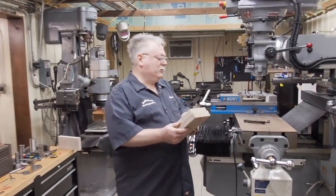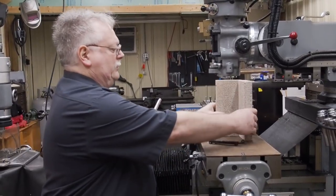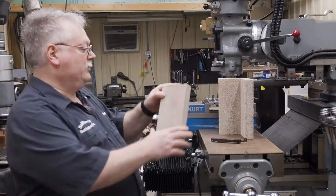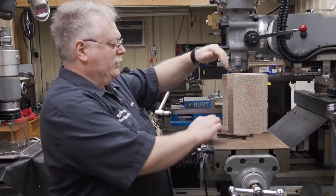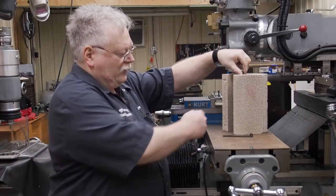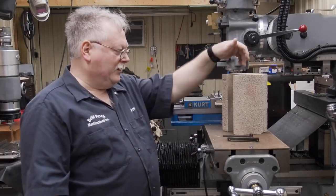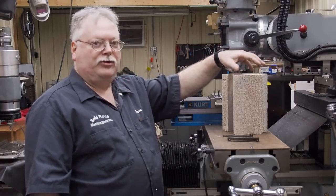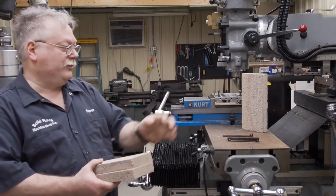What I did was get some fire brick — you can buy that at your local hardware store — and I just kind of set it up like so. You can set a third one in there, even put a top if you want. I had my wire and was heat treating with the torch, just dangling the part in. Because I trapped the heat and the brick reflected it, I could use just the one bigger torch and get the color I wanted. I knew I was going to get good results.